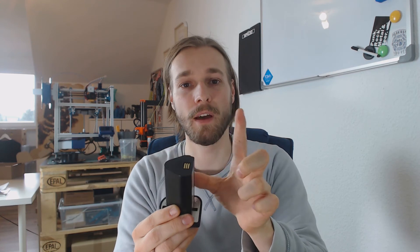It's really perfect. But this wasn't everything — I wanted to try flex material. So I designed three more versions. This is number five, using the same tolerances as on the PLA. You might think that should also work, but it doesn't. The PLA fits very well and doesn't move, but the flex, because it's not as rigid as PLA, comes off very easily.